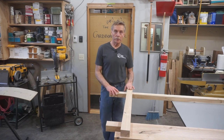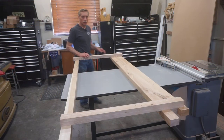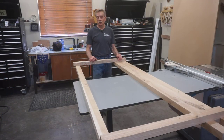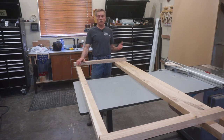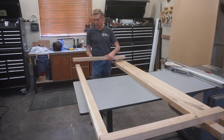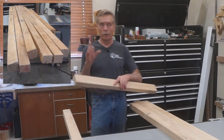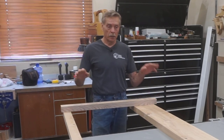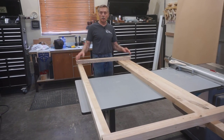You can see these pieces here — I've been working on these yesterday and today to get them to this stage. These parts as they're laid out are the border for the door frame. This door design isn't a traditional raised panel; it's all wood. I designed it to get the look I want and use pallet wood for the main part of the door, just making a border out of solid hardwood. This is ash — the three-by-four pallet runners from a previous video. I've selected and milled those down, picked and chosen to grain match, then glued up separated pieces to get to this stage.